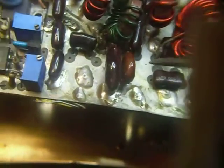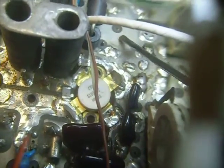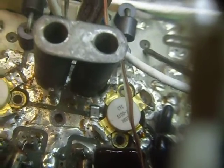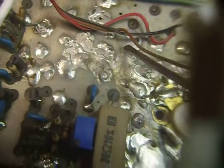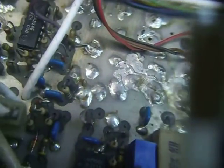So there is lots and lots of work to do. There are two large capacitors — there's one that goes right here, and then there's another one that goes back here, mounts right in this location. 2200 microfarads at 50 volts. Those are missing, so those have to be replaced.